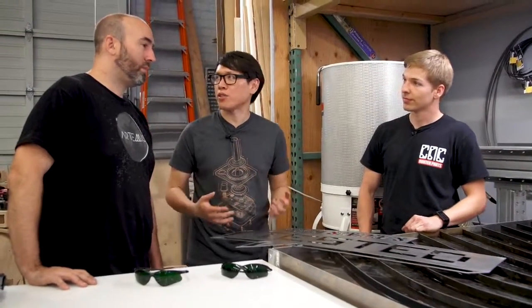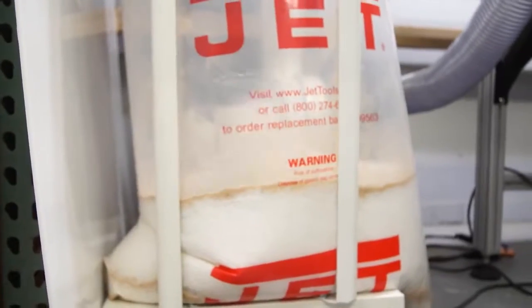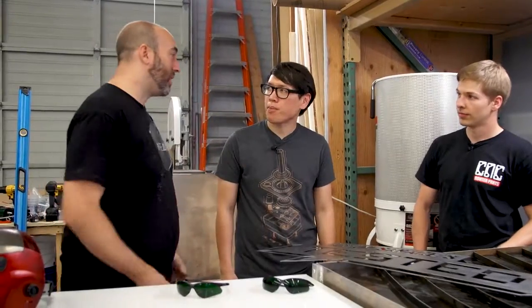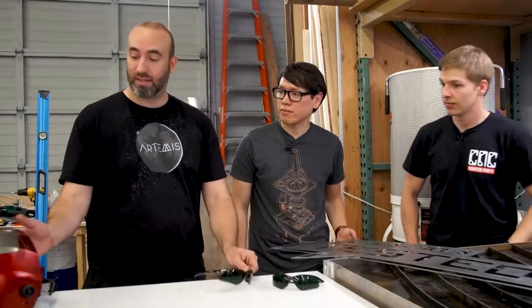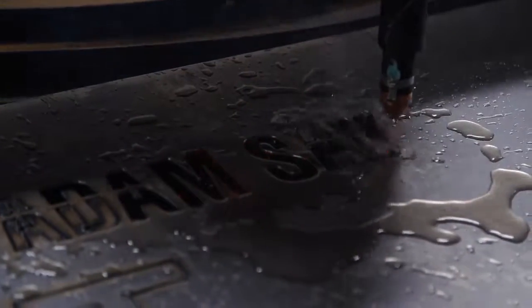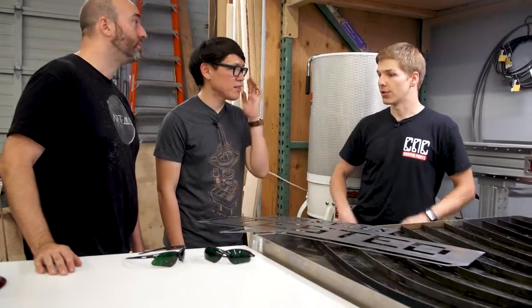Safety-wise, how do you equip a shop to run a machine like this? Luckily we have a lot of safety gear here — great dust collection for the router, and a big bay door we can open when plasma cutting and throw some fans on for ventilation. Eye safety is important — glasses and even a welding helmet when looking at the plasma. You need shade 5 glasses. When switching from CNC routing to plasma you also have to be careful that fallout doesn't catch any sawdust on fire, especially with MDF, which has a lot of fine particulate.